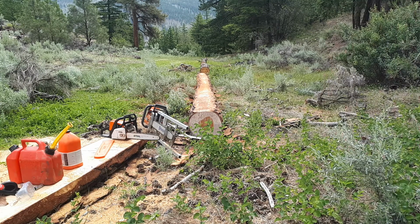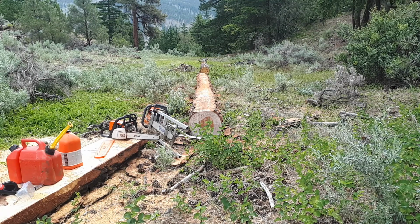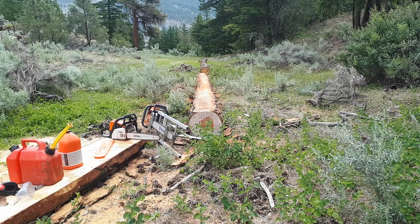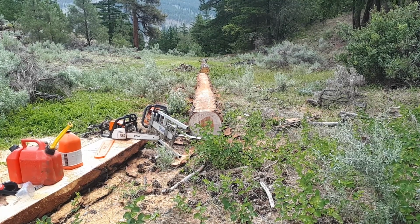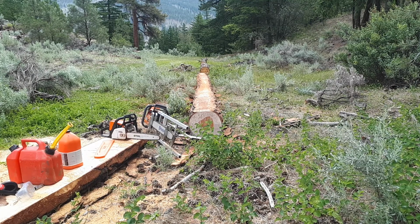And when you're cutting with an Alaskan mill, you want to cut even. You don't want to move the saw around. You'll see what I mean. I've seen other videos where they have sped them up, and I didn't like that. I wanted to see how long it would take to cut that slab. So we're going to do a 3-inch deep by about 10-inch wide.